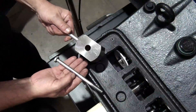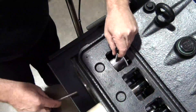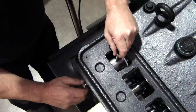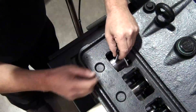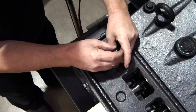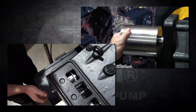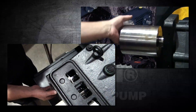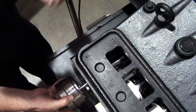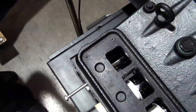From the top of the pump, install the packer pusher tool into the piston guide. Thread a plunger bolt to provide additional support of the pusher tool. After the plunger bolt is threaded, unthread and remove the pusher tool handle. Manually rotate the crankshaft. This will push the piston guide out along with the pusher tool and the packing retainer. Be sure to respect the O-ring position at the rear of the cylinder.